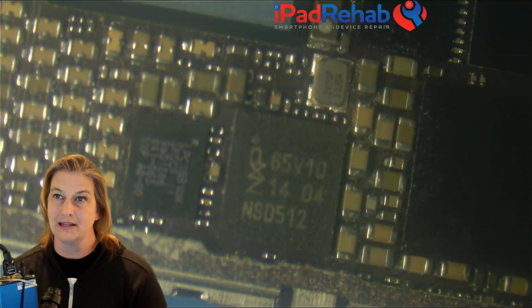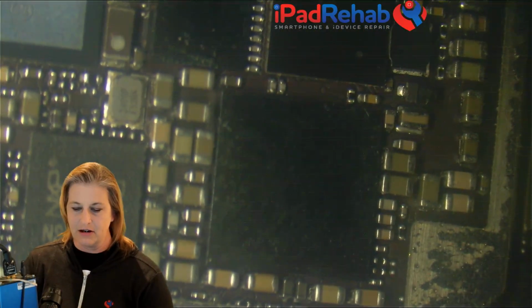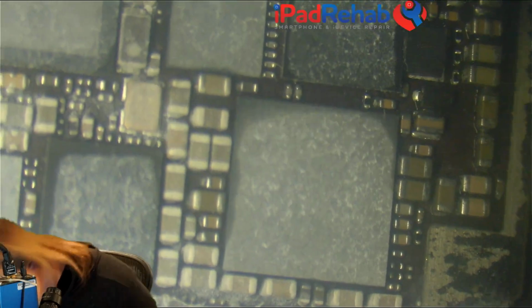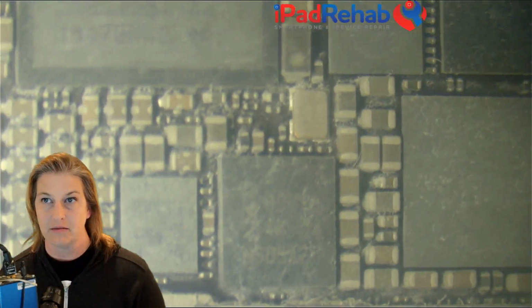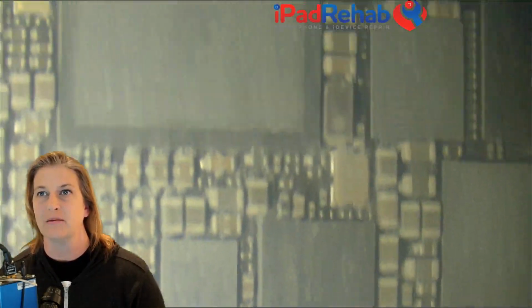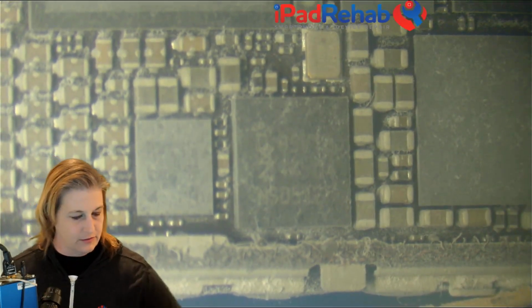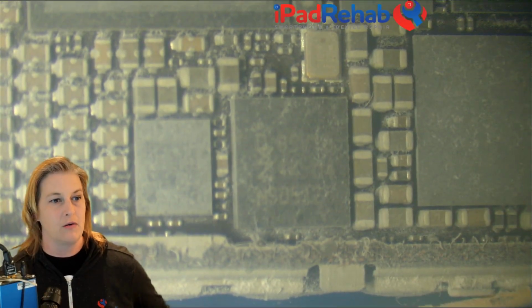All right, so I've got it connected to DC power supply. Let's freeze this sucker down. Everybody always likes a good freeze spray. Good freeze spray day. Plus, this is what it really feels like to live in Rochester right now. All right, so it was somewhere around here. It was around the PMIC, right? Not the PMIC, but kind of on this side of it. So that's what our face told us. Let's see if we can hone that in a little bit.